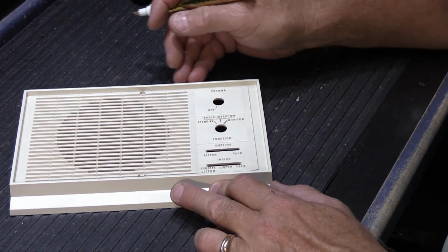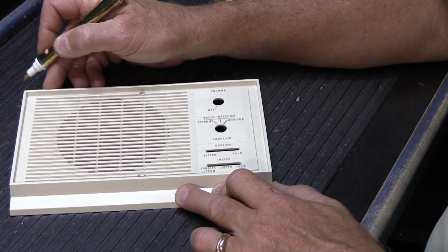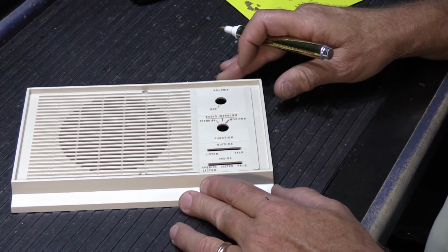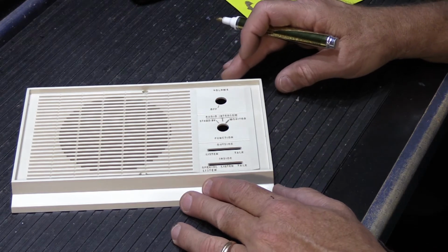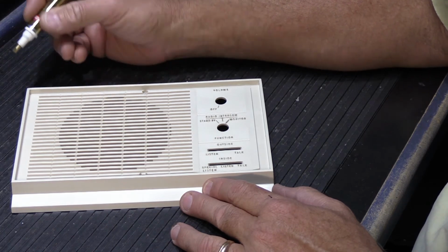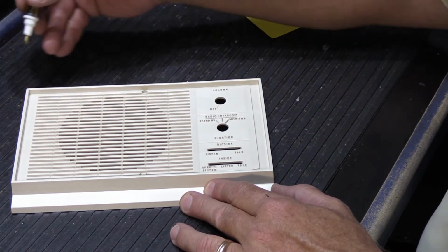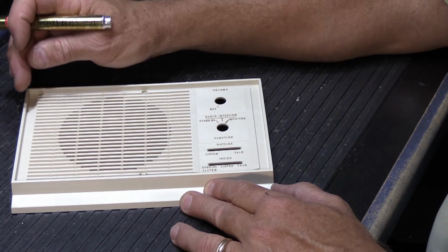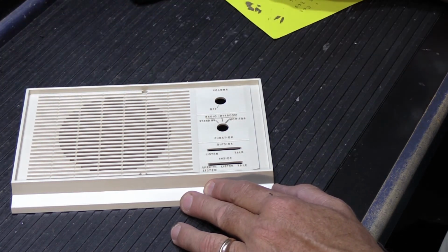Now these speakers are kind of nice because they have this area right here where it slants down, so there's a place that you can put your fingers to rest them up against as you slide it down as sort of a guide, and that makes it kind of nice. Some speakers don't really have that, or it's curvy and it's hard to hold it straight, so that makes it a little bit easier. The other thing you want to do is don't start right at the very end. Start in some, because see, this one at the top is going to go this way, but when we do the side it's going to go back up. And if you start right at the edge, it might bleed over and you don't want that, and you'll catch the little bit of the part that didn't get painted on the first stroke when you come up the other side. That's sort of the basic idea.